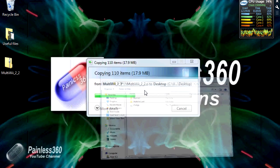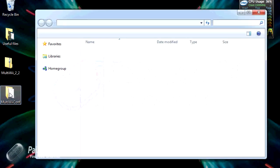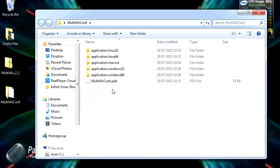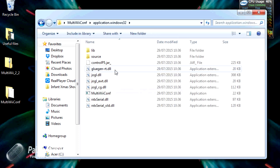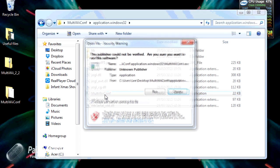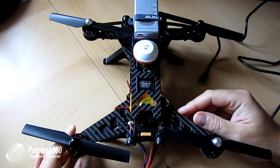Once that's on the desktop, I'm going to double click it. In here we have all the different versions of the application that we can run. The really nice thing about MultiWii is it's available on lots of different platforms — Linux 32 and 64-bit, Mac operating systems, Windows, etc. We are on a 32-bit Windows machine here, so we're just going to go into that folder and click on multiwiiconf. Now we've got our multiwiiconf of the right version, we can actually have a look at what's going on with the model.